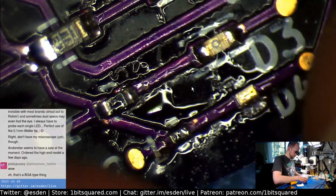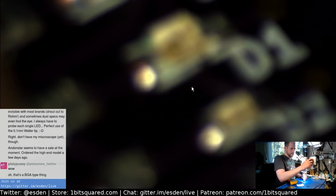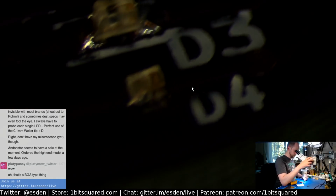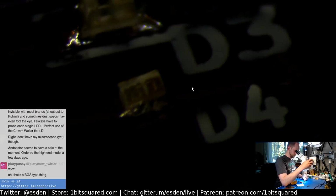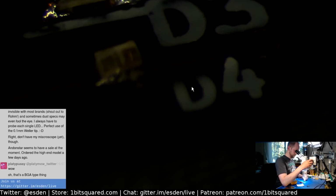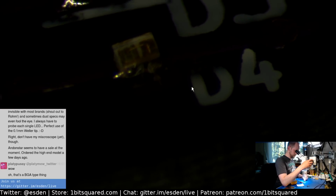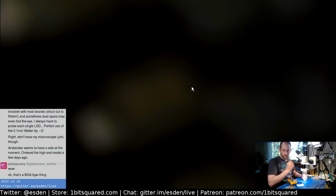Okay, let's see at the edge. Yeah, it's something similar to a BGA. Yeah, it's not great. My soldering is not perfect here. It's just sitting a little bit crooked on there. But I think I did connect it because it says it has 1.5 volt forward voltage.